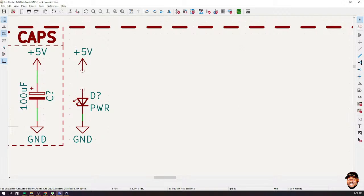Yeah, because I see some designs that some people put in 5.1K, others 1K. Now, if you put a 5.1K on an LED path based on 5 volts, you are basically telling it to have just 1 milliamp flowing. Maybe they use 5.1K, but not on the 5 volt line. If you put 5K on the 5 volt line, calculate the current and see. That's too small. Well, some people put it on a 3.3 volt.